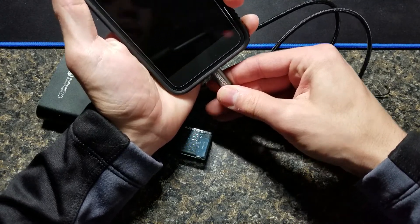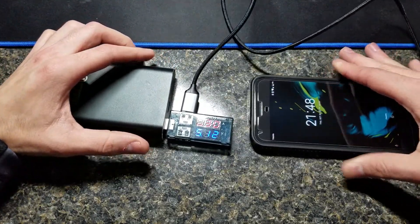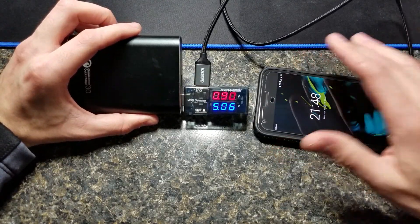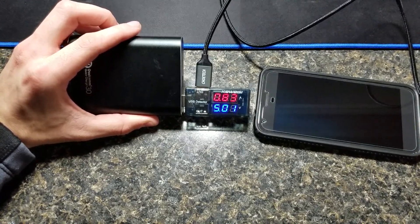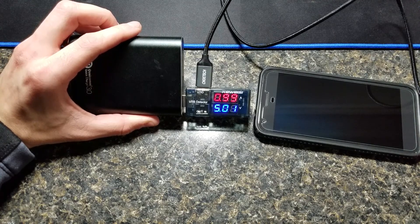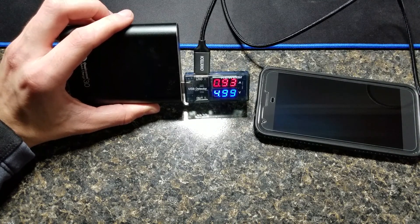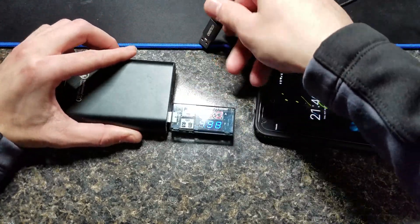Let me plug this in here so we can see what it's reading at. Looks like the battery turned off, so I'm going to turn it back on. At most I should be getting 1.5 amps, because that's what it should charge at — you shouldn't be pulling 3 amps or anything over 5 volts from an A to C cable, per the USB spec. Looks like we're getting just under an amp at 5 volts, which is perfectly fine. As long as it's not over that, that means it does have the proper resistor.